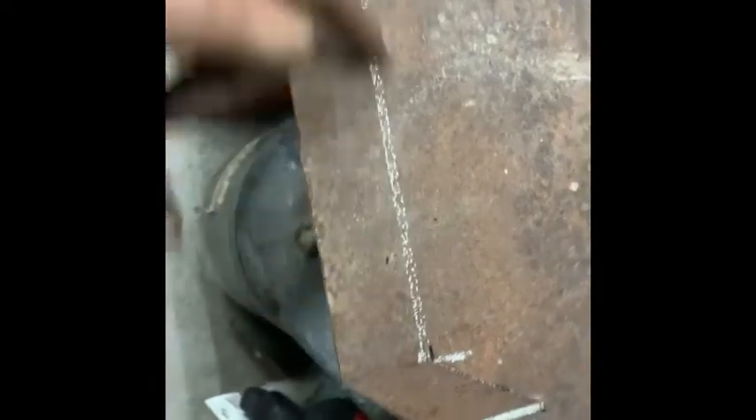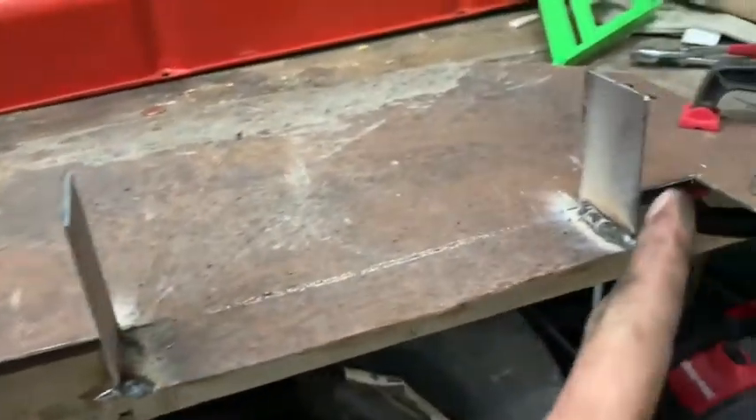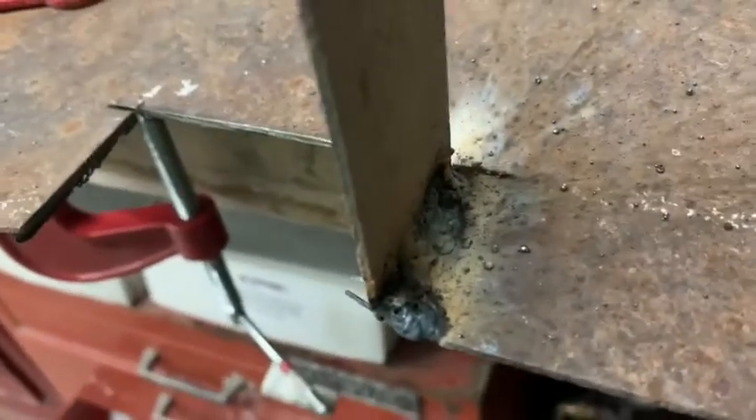I'm not going to grind the rust off — I chose these pieces on purpose because they're rusty and crusty. That's kind of the look I'm going for. Now all I got to do is get these all the way back over, and while it's clamped down I'll weld in these, then flip it over and cut this from the back side — it'll just be easier to get my grinder in. Just a couple of minutes later, got these squared up, welded all the way along here. This one wasn't as pretty — I did three tacks and then blew through right here — and then welded all the way across. Pretty ugly, I am not a welder, but it is what it is.